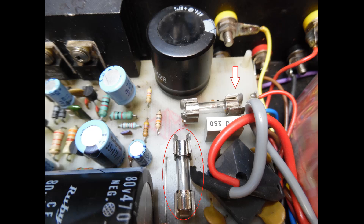The second issue: one of the power supply protection fuses has blown, indicating the amplifier drew excess current or there was a surge on power-up. On closer inspection, the fuse was blackened and vaporized — not just from a normal power cycle — which confirmed the amplifier had drawn excess current.